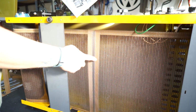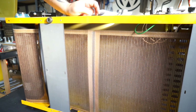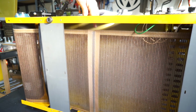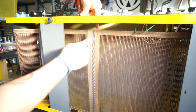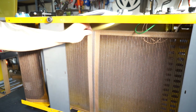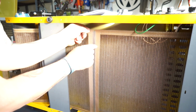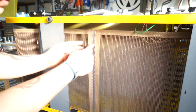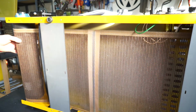Line the edges of the belt, insert the belt connecting pin. So the belt connecting pin, I lined it up to one of these holes, so I could push the pin down through there. As soon as I got through the first two, all I had to do was lift up on the belt, and it kind of drew it in closer. As I pushed it through, it just sucked them all together. So it went in really, really easy.